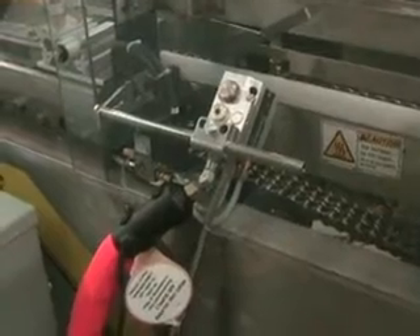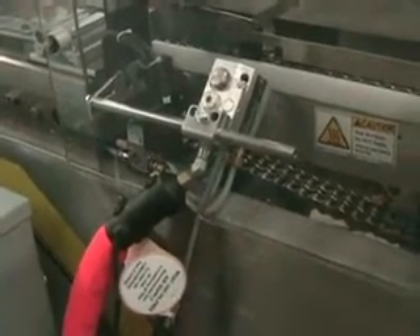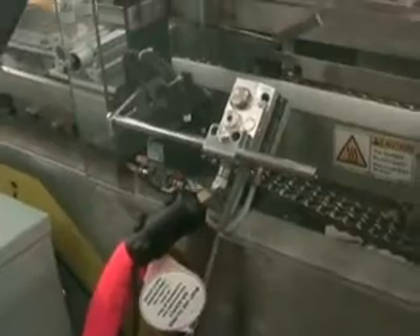The loaded carton is then sent ahead through a variety of flap closing stations and then, per customer request, is glued with a Dynatec ITW Dyna Mini extruding system, then through pneumatic compression and discharged as a finished carton. The finished packages then go onto the outfeed conveyor and into the collator stacker of the case packer.